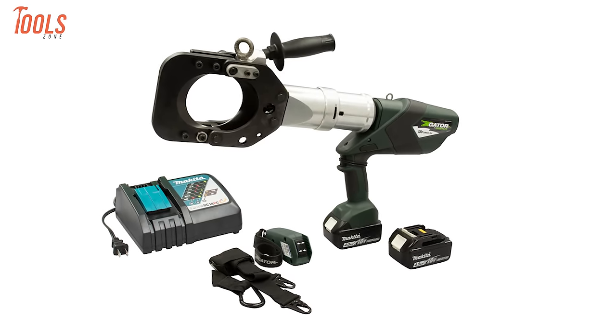Speed up twisted-pair cable processing with Kabatek's KTB-50EG spot taping machine. This innovative tool eliminates inefficient manual taping frustrations by detecting cable diameters automatically and dispensing the perfect tape length for superior terminations every time. Built-in sensors guarantee wires are positioned correctly before precision taping, while self-cleaning cutter blades slice tape cleanly without messy buildup. Customizable wrap programs prevent waste. The 50EG allows electricians to tape terminals 50% faster versus hand finishing, saving hours over long workdays. Maintenance alerts are displayed automatically too.